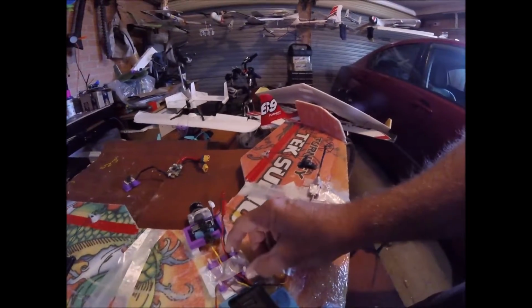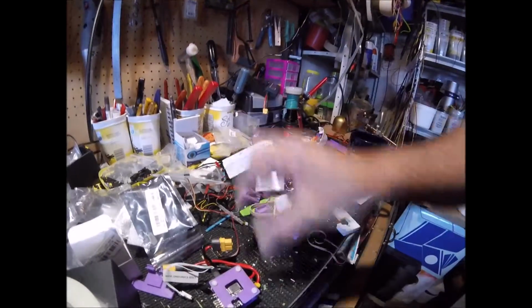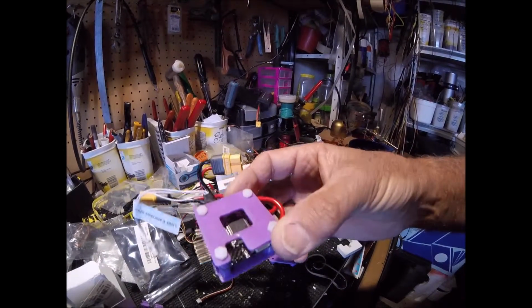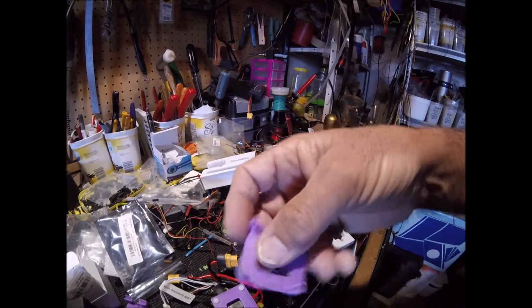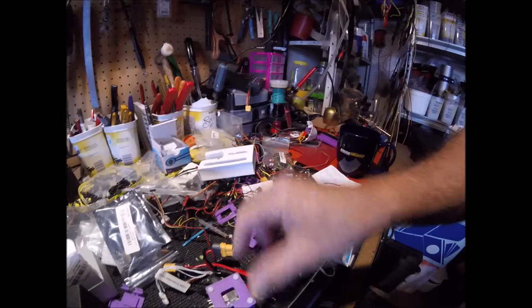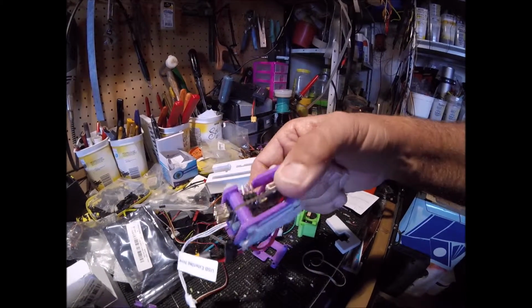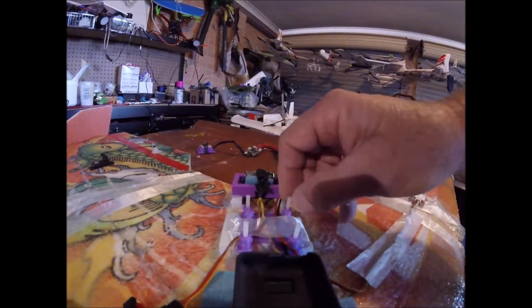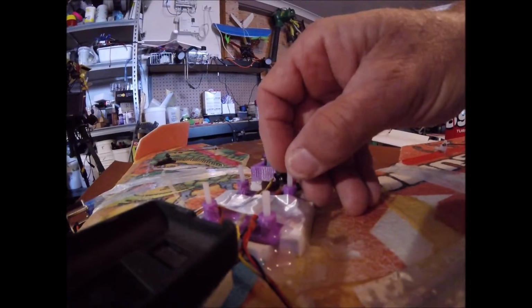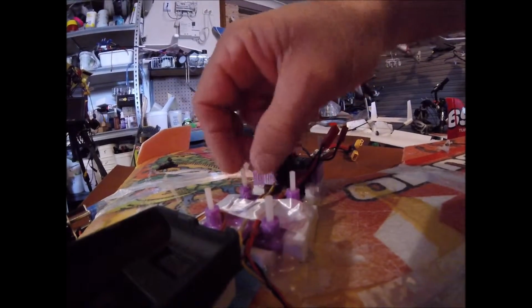What I've also done is I've 3D printed, whether I've got another one here, yeah, there it is. I've 3D printed these little board mounts up, and I've made different ones so you can actually screw the threads in there. One of these is actually screw threaded. Made smaller ones. Anyway, that's off my Ranger, so what I'm going to do is leave the top, but in order to get it level, I've glued these bolts in here, and those bolts are fairly long so they don't turn. The idea is to put a nut on here, and you can have your nut set at the right height for level and then put your board on it, rather than try and get this whole thing level.